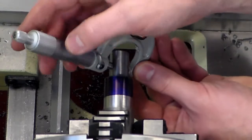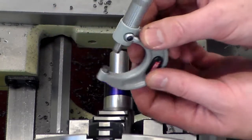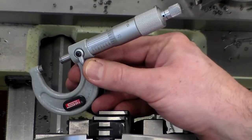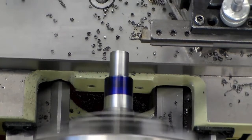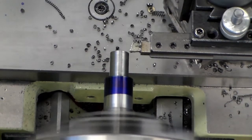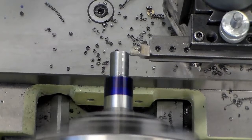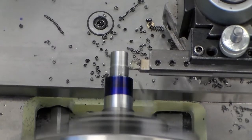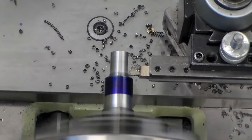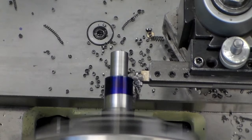This will be my last measurement before I dial to my finish size. I'm reading about .671 and my finish size is .625, so I'm going for it — because you don't want to get in the habit of trying to stop five-thousandths shy. You'll just get really good at landing at the wrong number, and then it takes more time to file and polish to finish size. With the tolerances on this project that's a waste of time, so we don't want to build those bad habits.